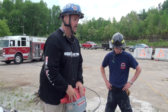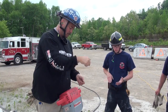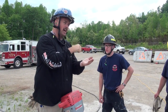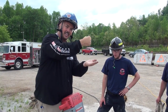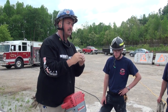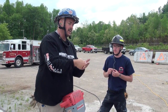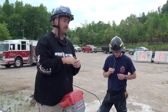The hammer is designed to go up and down — there's a piston inside that smacks the spike every single time. When you're listening to it, you want to hear that bit going ting, ting, ting, ting. If it's just click, click, click, click, it's not doing anything because your bit is stuck in the concrete. You have to get it up — it needs to bounce. That's what makes the concrete break. Listen when you're running these breakers; big ones, small ones, doesn't matter, same principle. That piston hits the bit every single time — all you're listening for is that ting.